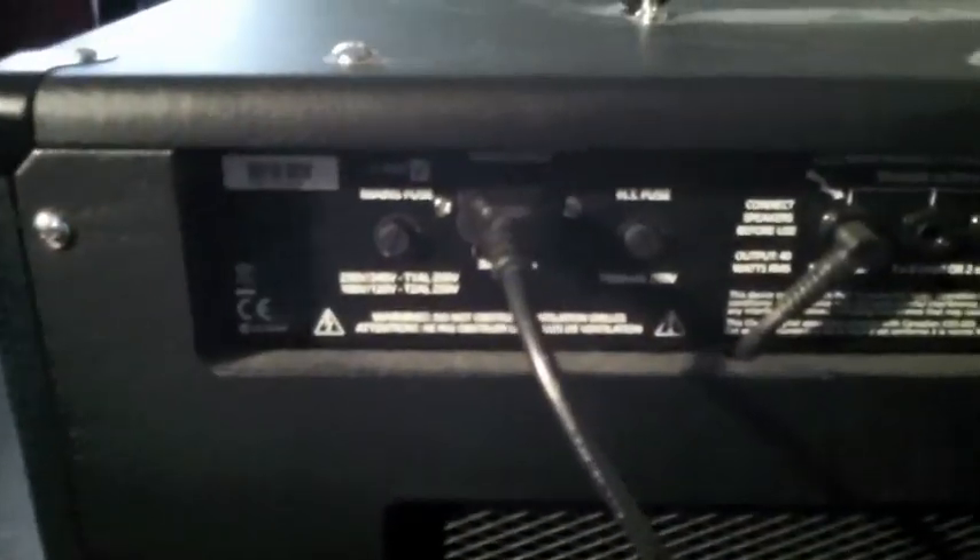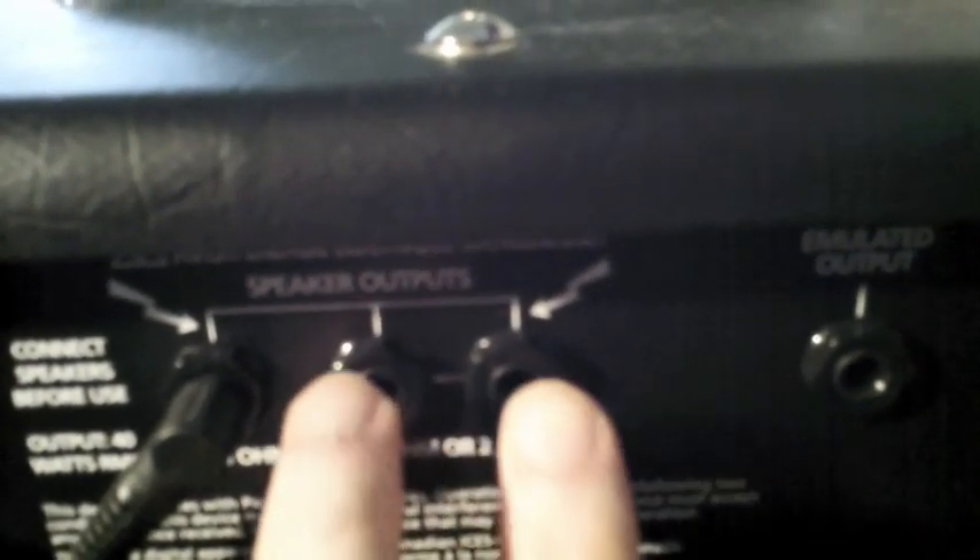Now let's move on to the back panel. This is an EL34 tube amplifier, sounds great. We've got the power cable here and the speaker connectors. This combo comes with a Celestion speaker, it sounds very very nice with this amp, and you've also got the option of adding extra cabs with these two speaker outputs here. We have an emulated out which is a very useful feature for recording at home, and we have our reverb control — a dark and light switch to make it obviously darker or lighter. Here we have the effects loop, which I've got my MXR Carbon Copy delay running through, and it also has a level control where when the switch is pushed out you get a plus 4 decibel boost whenever you switch your delay unit on. And then we've got our input jack for our footswitch.